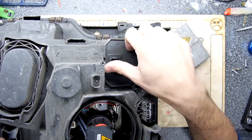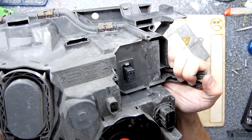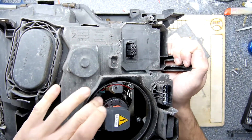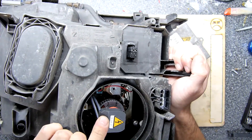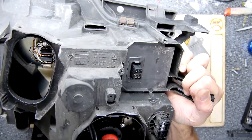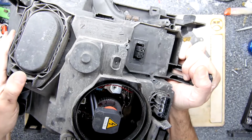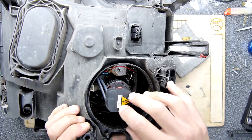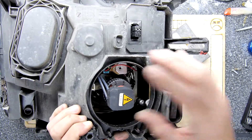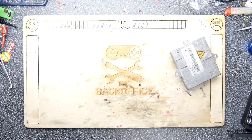Just dusting that off — fortunately there's no corrosion on the connector, so let's assume all this bit is okay. While we're here, let's have a quick look because you've got this bulb and it does have a ballast — those two wires must go to a ballast somewhere, which I suspect is also somewhere within this lamp module and it doesn't look like it's accessible in any sensible way. I was hoping to find a serviceable part so I could swap it with the one on the other side of the car, but it's totally bonded in there. However, I can probably do the same with these modules — I bet they're the same on the left and the right.